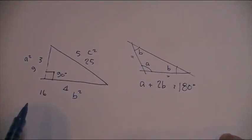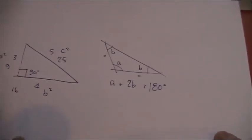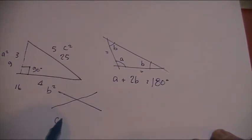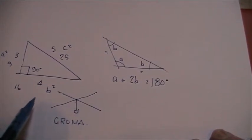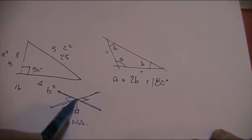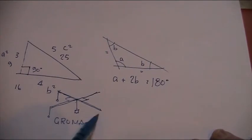hey. So going back to the even better older days, the Romans had a system which they used, which was essentially a cross, slightly isometric view here, and they called this the groma. And the idea was that this would have a lead weight bob in the centre. This whole thing would be suspended from a post driven into the ground, and these beams would be at right angles to each other and of equal length. Each arm was of equal length, beams at 90 degrees, lead weights as bobs hanging vertically.